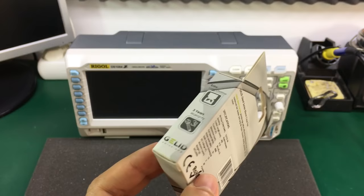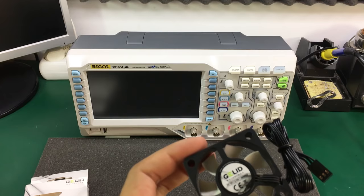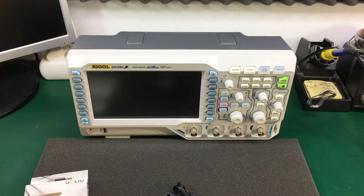I'm not expecting a massive improvement in noise, and I was discussing this over email with one of my viewers, because part of the audible noise is made by the fan assembly and blades themselves, but part is made by the air turbulence passing through the vents in the metal and plastic enclosure of the oscilloscope, and there isn't much we can do about those. I'm not going to start butchering my oscilloscope by making additional holes and cuts into the enclosure.